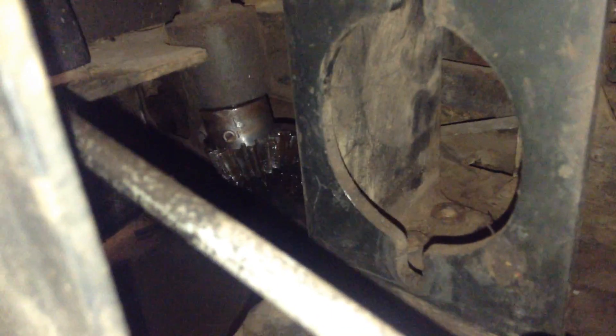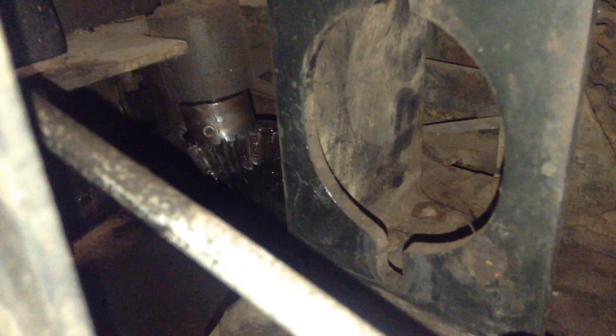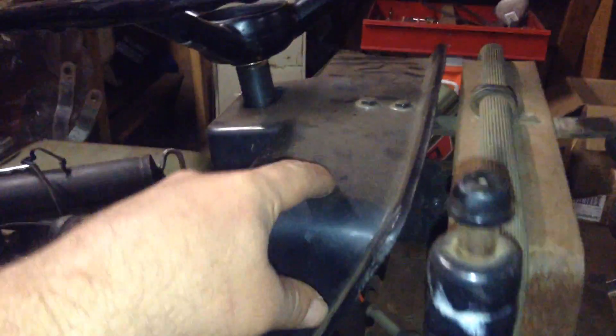This mower here, you can see on our MTD 760 — nice tight steering. I recently re-shimmed it and put a new bicycle chain for the clutch, because that whole chain was junk. The dash is almost mint, which is really nice. It's got this brace here that takes the pressure off the dash. The rear axle has all new bearings, seals, and brand new shift rails in it, so that's completely rebuilt.